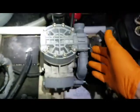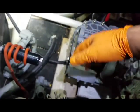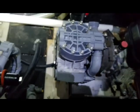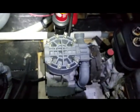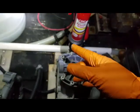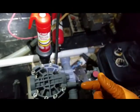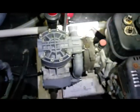This side was definitely worse than I was expecting. This side being the outlet is going to take more abuse than just flowing through, because it's not in there as long — it'll sit there longer especially when you shut down the machine. Some air might get in there depending on how your plumbing is. To eliminate the air bubble, what we do is actually loosen the inlet to let the air escape and the water to come in.